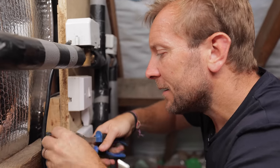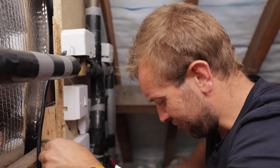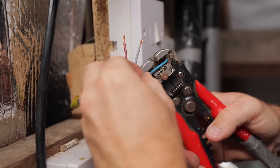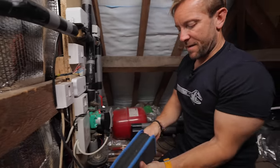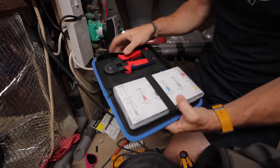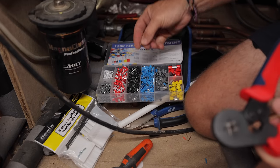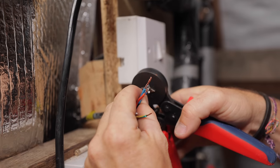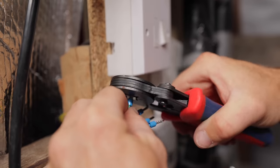We're just stripping back the wire. Twiddle them up. We're going to go just a little bit further. Now get out my little crimping kit - you can buy this on the Amazon store. This is an absolute lifesaver if you're doing any electrical work. Select a nice size crimp - the blue crimp seemed to work quite well for me. Run a crimp on there, crimp it up, give it a couple. It's just the best way of doing it. Do the same to the other side. And remove the fuses - if we've got fuse spurs, remove them.